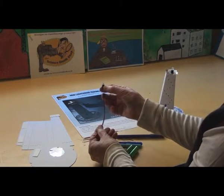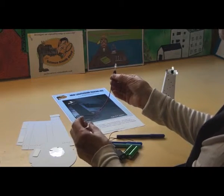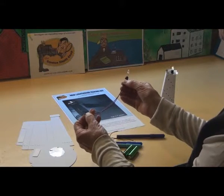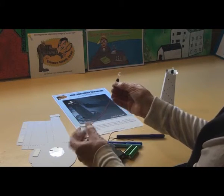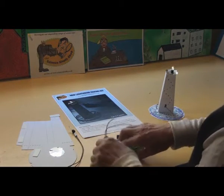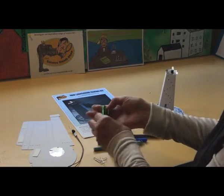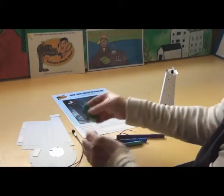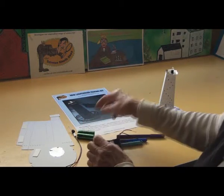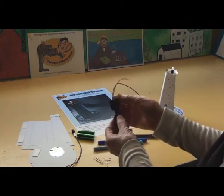It's got an LED mount and an LED connector. The red wire of the connector has a soldering tab for joining in the wires of the circuit. You'll see that later when we work on it. The next thing are 2 batteries. This LED works from 3 volts and you get 1.5 volts from each battery, so you need 2 batteries. But it will run forever really on the 2 batteries. You'll hardly ever need to replace them, even if you leave it on all the time.